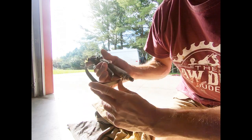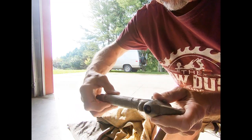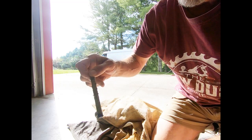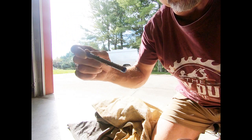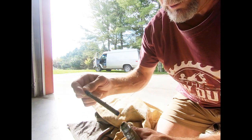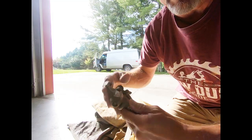With the gun, just lift it up and unthread this section — there is a screen or filter inside the gun handle. Pull it out like this. You can see all the trash and gunk in there. Run warm water through it to keep it cleared out. This little filter in the gun is a lifesaver — it's the last filtration that collects any junk from your paint bucket or the stock paint before it ever reaches the jet on the nozzle.